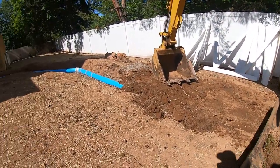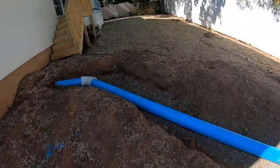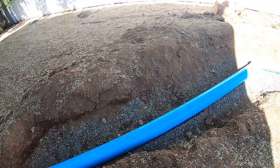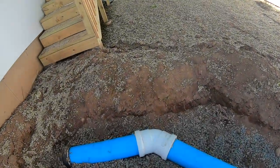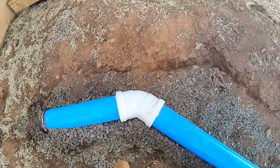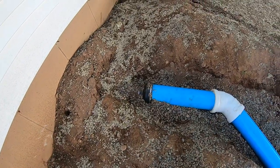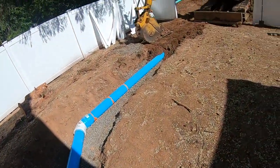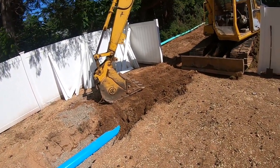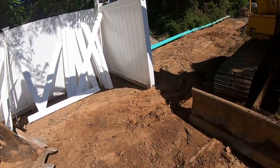So that's what they make you do if you're not down to at least 42 inches deep for the frost line - they make you put in this heavy-duty sewer pipe with really thick walls. It looks like that's just a Fernco six-inch to four-inch coupling there. There's the John Deere 190 - I put the excavation bucket back on so I can backfill faster rather than using the trench bucket.